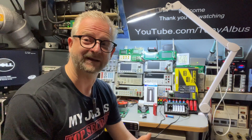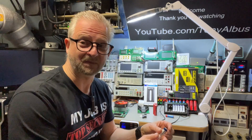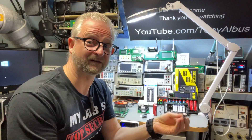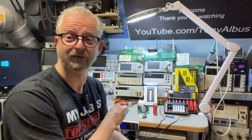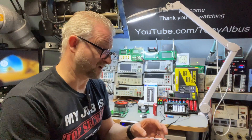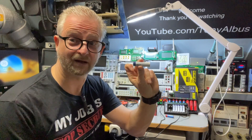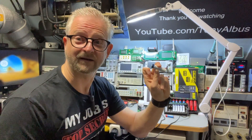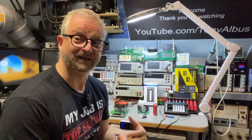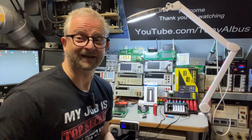When is the battery empty? Is it empty when it is zero volts, or when it doesn't work effectively anymore — like this one is 1.5V? If I start measuring and set my cutoff voltage to zero, it will drain it completely. Is that a good test? Or do we say 1 volt, 0.9 volt, then it's empty? Because if I put the battery in my clock and it is lower than 1 volt, the clock probably doesn't work. So in that sense, the battery is empty for me.